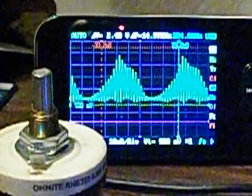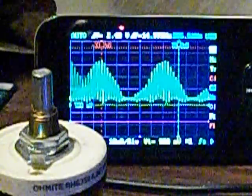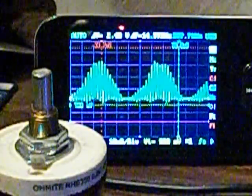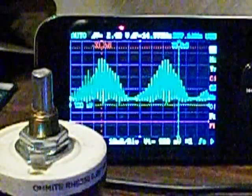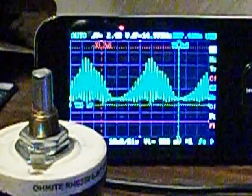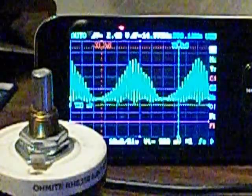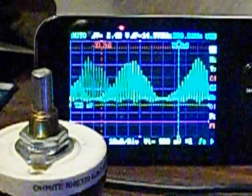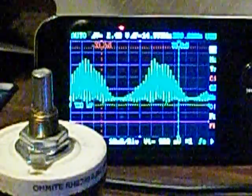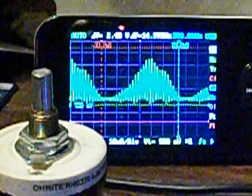So, as you can see, I'm pretty pleased with this. I got a lot of light output going on here. I got a small toroid. This functions a little better with the 2N2369A as opposed to the 2N2222A, both being original Motorola components. That's at like 389.2 kilohertz now. And it's a very interesting waveform in my opinion, it really is.